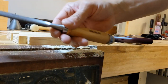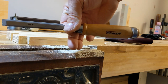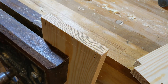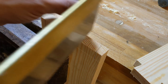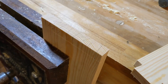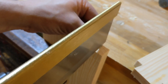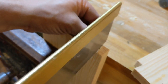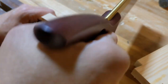So I'm going to go ahead now and just do a bit of tidying up of the joint — tidying up the waste — and I'm going to be using some of those really cheap chisels from Amazon. What's important is we want to be accurate as we go across and as we drop down, and we need to make sure that the saw kerf is in the waste. So the waste is here — we don't want to be on this side, we want to be in the waste side, otherwise we've got problems. So again, just a light touch on the toe, and then just let the saw do the work.